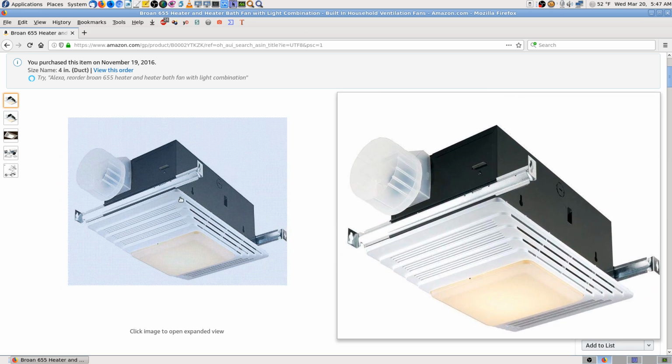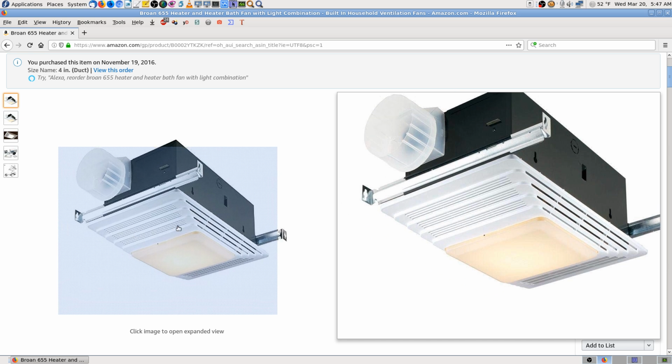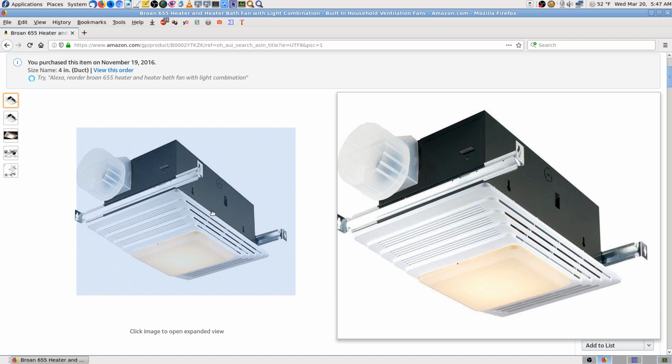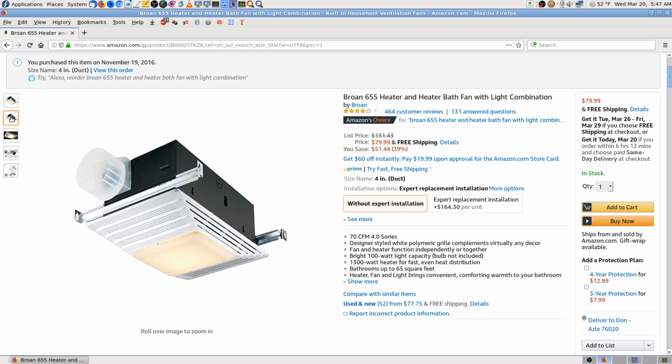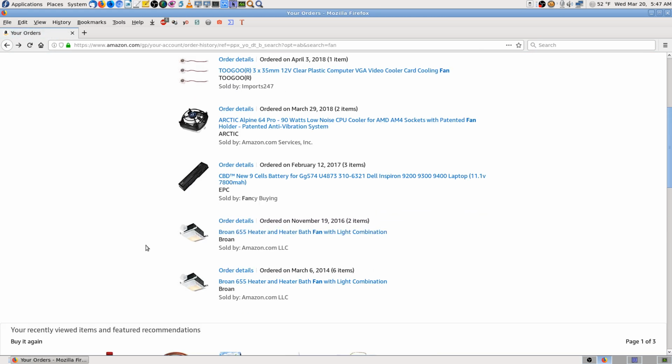Just don't make a mess out of it, because you don't have more than about a half inch of space around the outside on the right and left side of that box. You might have a little more on the ends to make a mistake. And then just use your sheetrock saw to saw it out. Hand saw, I'm talking about. If you've got fancy routers to do that with, good on you. I've got regular routers, but I wouldn't drag them up in there for that, because they're going to blow not only all the sheetrock, but all the old 80-year-old insulation in the attic up in your face. You're going to breathe that stuff, and that kills you.